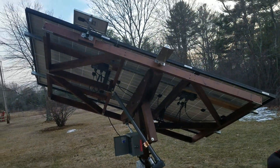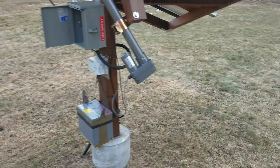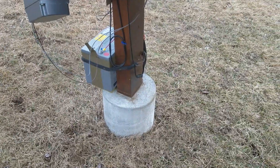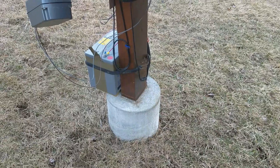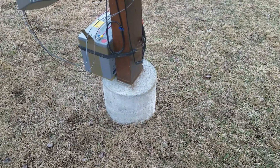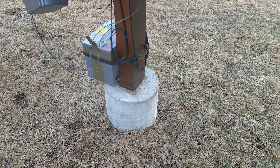That's a pretty simple setup. What I did with the 4x6 post going into the ground — I went down about 4 feet, so there's about 5 feet of concrete there. That's a 12 inch sonotube. I wanted to go 16 but they didn't have any, so 12 did it fine with no issues.